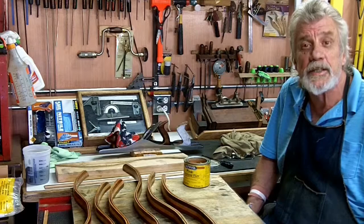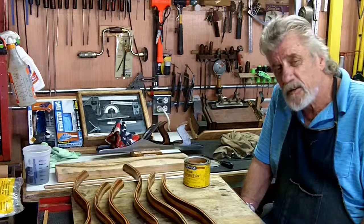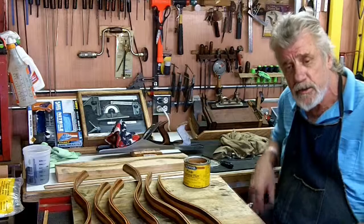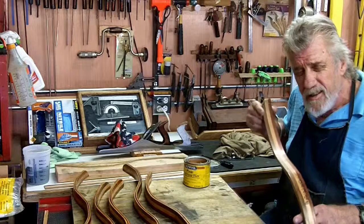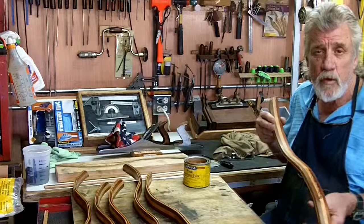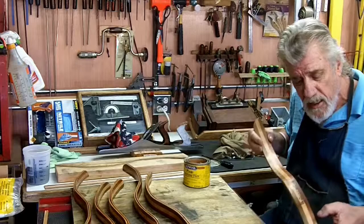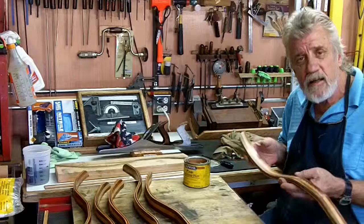One thing I know about the buffing wheel is that it can really be your servant, or it can be your nemesis, especially on wood or metal, where it can really hurt you. It'll catch you and throw it back at you. So when you're using a buffing wheel, especially on wood, use the lightest hand, almost just the weight of the wood. You can buff this out by hand. That wheel goes to 3,400 RPM, so it goes fast, and if you catch an edge, it can burn this thing. So don't let the wheel bounce, don't catch an edge, just let the wood rest on the wheel, and it'll shine up real nice.